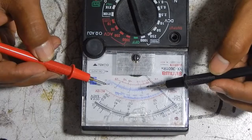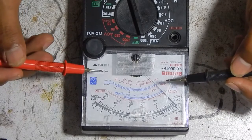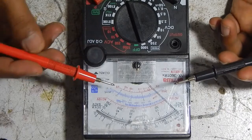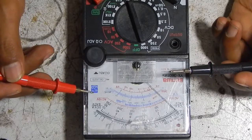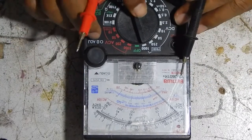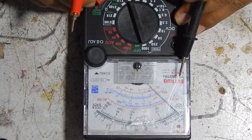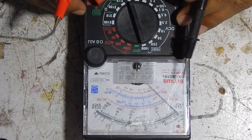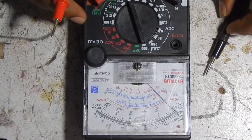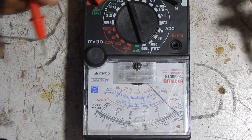You can then find which component is broken there. Once again, if you want to find a broken component at the shorted land of the laptop motherboard, use this multi-tester and select the ohmmeter option — you can select x1 or x10. I always use x1.